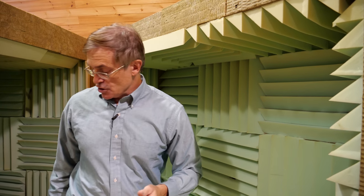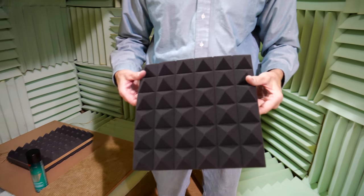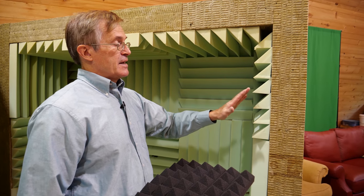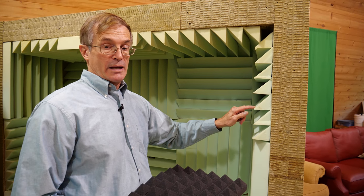Underneath this foam is a double layer of 35mm Roxul foam held off of the MDF by small foam spacers, so there's a little air gap behind it. The foam on top is actually mattress foam, because the acoustic foam you can normally get looks nice but is very lightweight and relatively expensive. We bought some mattress pads and cut them into rectangular bars — three by three inches, or 75 by 75 millimeters — then on the angled bandsaw simply sliced each bar in half to produce the wedge shape.